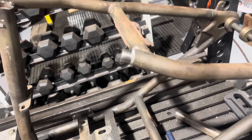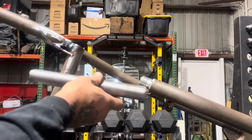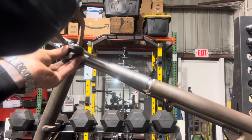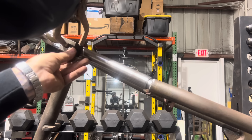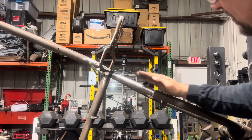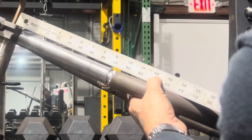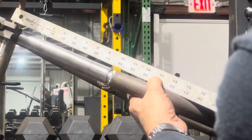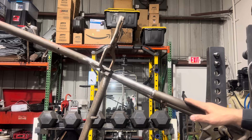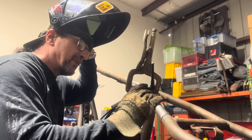There's my internal slug that's going to align and support my joint. Here's my piece of tubing - I cut a V back here too so I have a V joint - and it just slips right over my slug. The way this frame was originally made, there was a bend right here. I've taken most of that out. The tube was probably about three-eighths to half an inch higher, so I'm bringing it down a lot. It's going to really change the lines of this bike. I know it's not a big change, but that little change makes a huge difference. I'm going to go ahead and tack weld this, then cut the other side and tack it up. Once both sides are tacked and I'm happy with it, I'll finish weld everything.